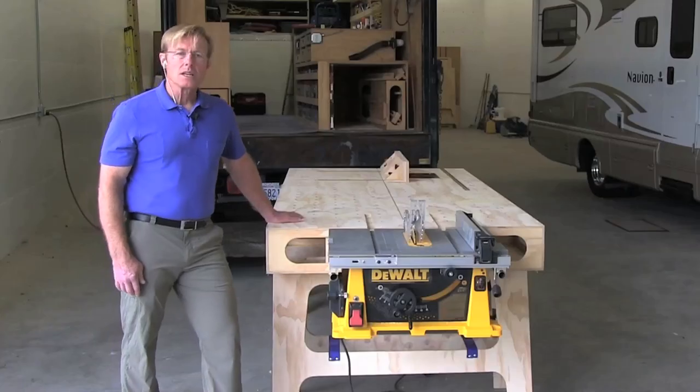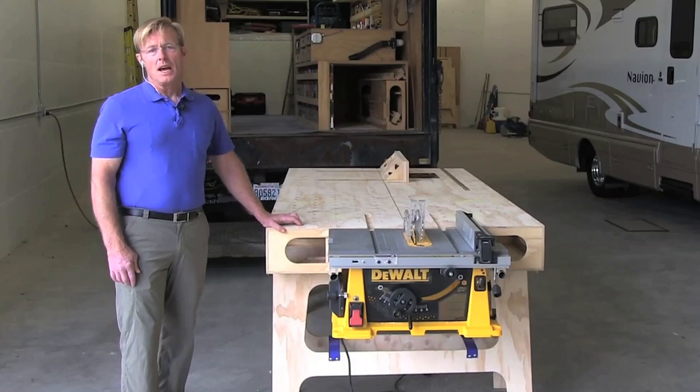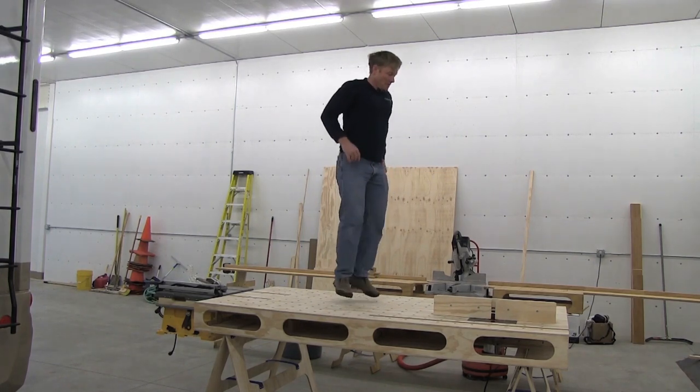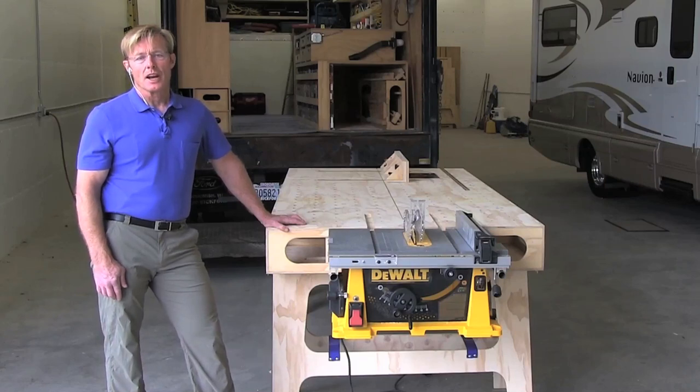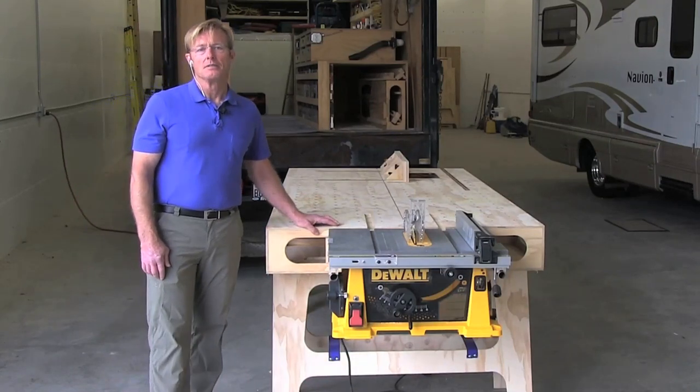And obviously, to hold things like mantles and cabinets, the bench needs to be quite sturdy. So what made you opt for using half-inch plywood rather than three-quarter-inch? I decided that the design I was working with — more of a truss, a box beam — I was going to get the strength from the engineering and not from the mass. I knew that building this box, so that I could have an inside usable space, I would not need the mass — that the half-inch would be as rigid as the three-quarter. And that gives me the added benefit of reduced weight.